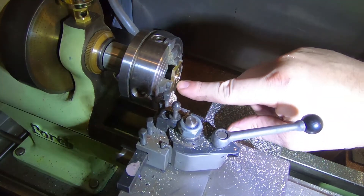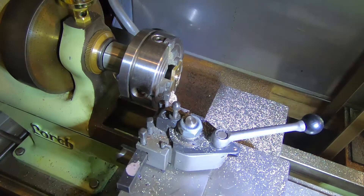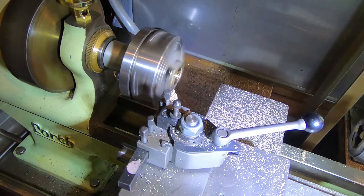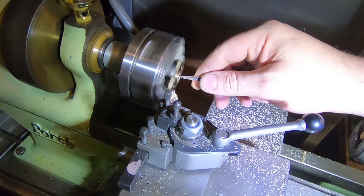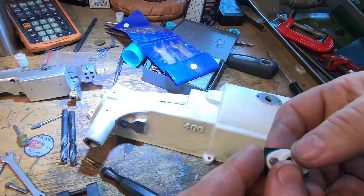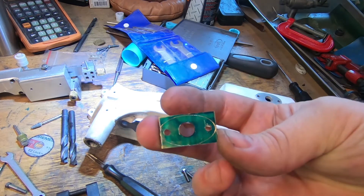Next job I guess here is to take this burr off, take him out, mark the back of him and sand it to profile, but before we do that I really need to drill this. So that's what we've got — holes line up, which we're really pleased about. Now I've just blued this and marked the back around the plastic template, which seems to be probably a cheat's way of doing it but it seems to work, and we've got an oval there.